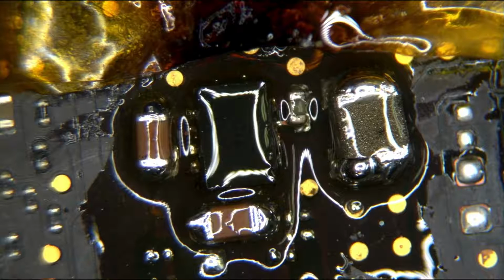This is what makes it. So this was short. This is a capacitor that goes to ground. This was shorted. These two were burned because this was shorting the ground. So I replaced this, and now it's still not making what it's supposed to. This is what makes 3.4 volts, but it's not creating it. So I think R6995, R6996, this is the feedback network that's supposed to tell this what it's doing, and I don't think it is.